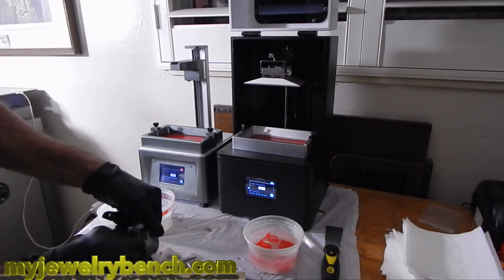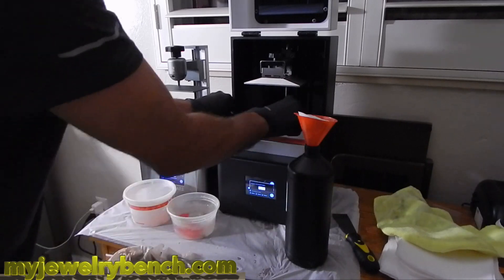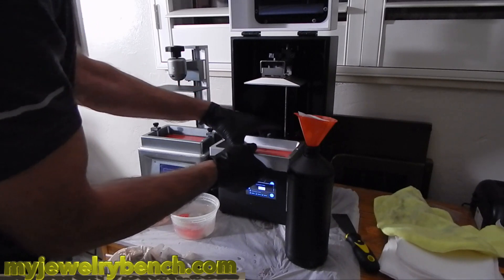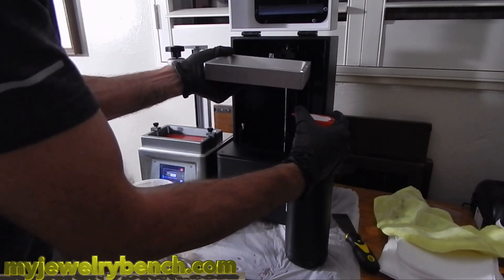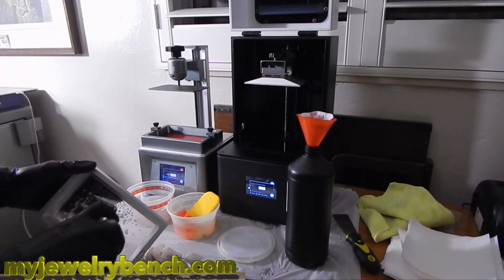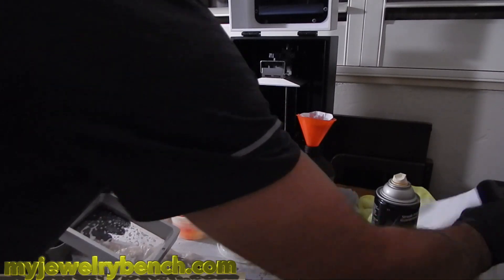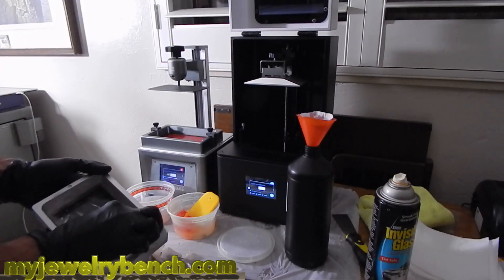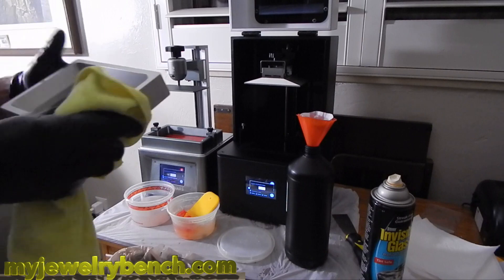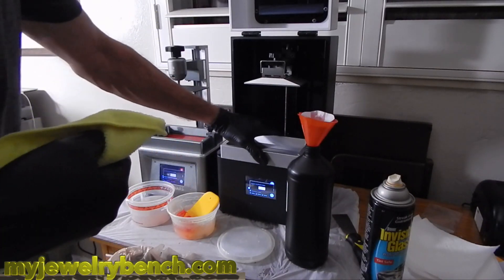With any resin printer, you always have the cleanup time — allot yourself about five minutes to clean up both printers. For just one, I can do mine in about two or three minutes: get the build plate cleaned up, empty out the vat, clean it all up. I always recommend cleaning up after a print. If you're going to print more, you can leave the resin in there for about a day or two, but be careful because the resin will start to coagulate. If you're not going to print for a couple of days, it's always a good idea to clean up and get everything ready.